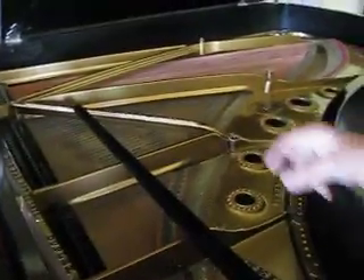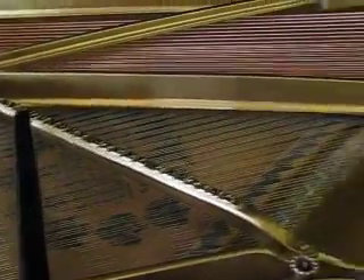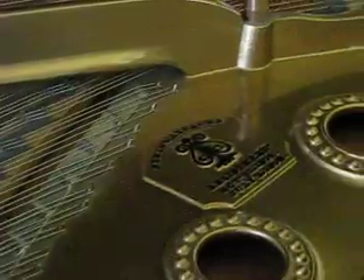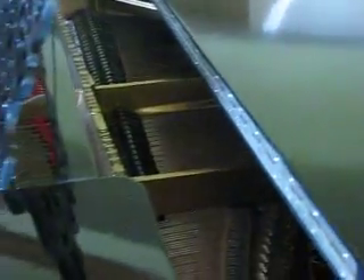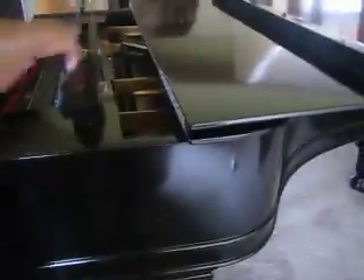It's a beautiful $200 Steinway soundboard decal, right here underneath the strings. All the lettering has been hand-painted and hand-repainted. The soundboard was shimmed and resurfaced. All of the surfaces have between, I would say, 20 and 40 coats of finish — the difference being the music desk having fewer coats than some other parts, because it's very thin and you don't want to overcoat thin pieces.